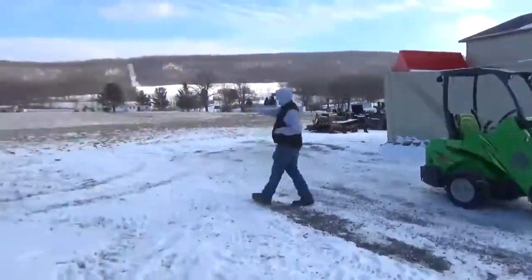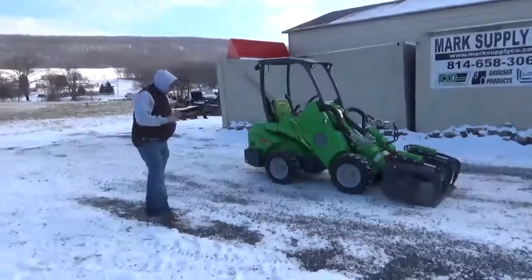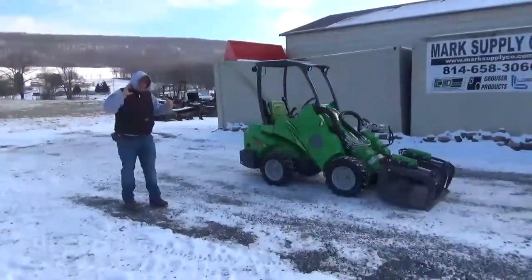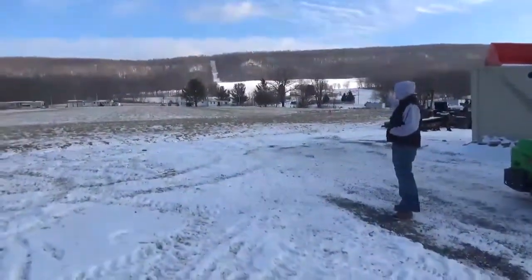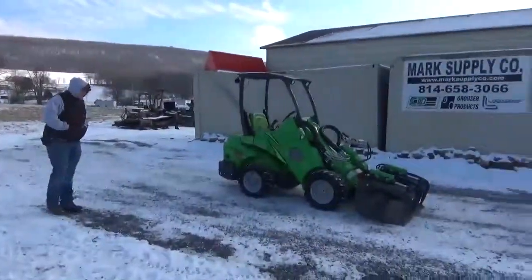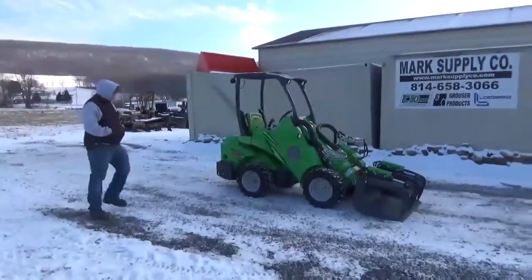Now, the reason I wanted to go over here in my swale ditch, I have watched countless videos on these machines. How their traction lock works is it's going to give whichever wheels have the most grip the power, which you've seen just as soon as a wheel slipped, everything else grabbed and took off. What an amazing machine in a V-ditch like that. Crazy efficient.